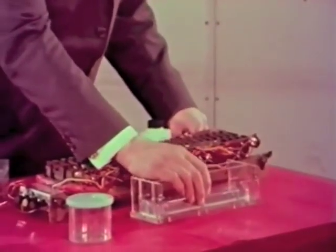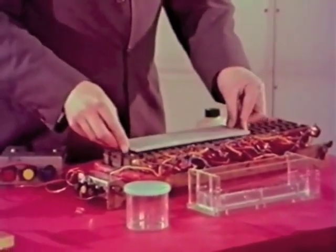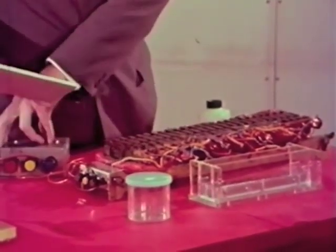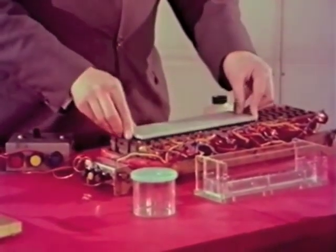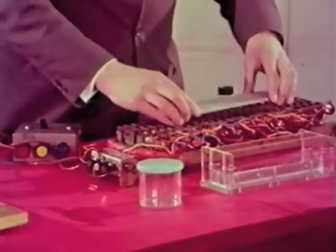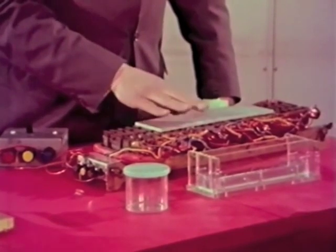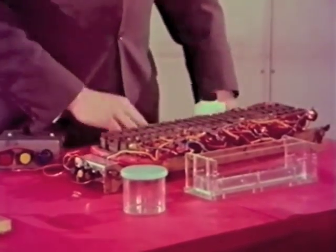It isn't easy to see mercury flowing, but you can float a coin on the river — and I hope that convinces you that we can pump fluids electromagnetically. Now this same magnetic field is much more potent if it operates on an aluminium sheet instead of on the mercury. The reason for this is that aluminium is about 40 times more conducting than mercury. I could make it more potent still if I put some steel behind the aluminium to improve the magnetic circuit, but instead I'm going to change the shape of the motor.